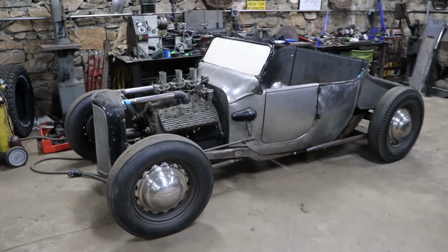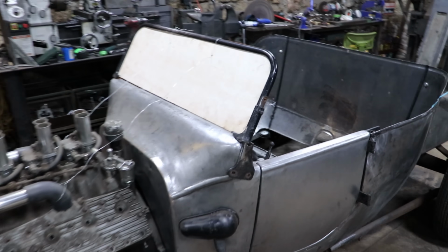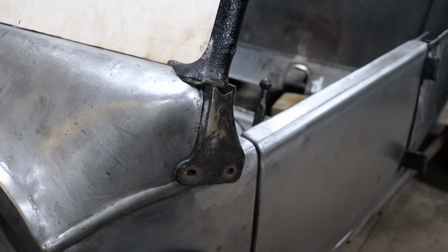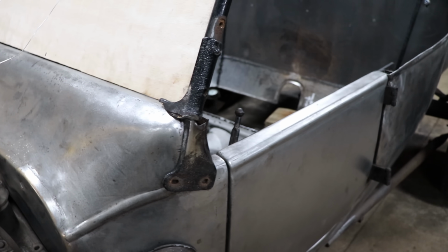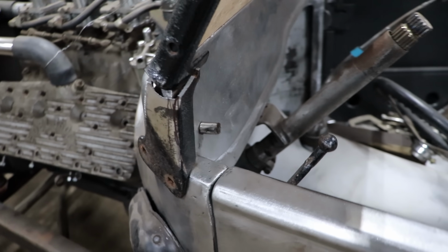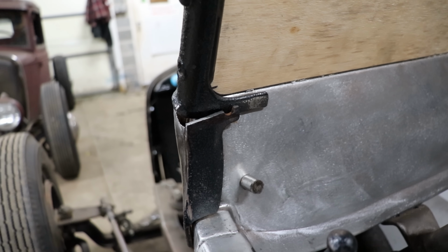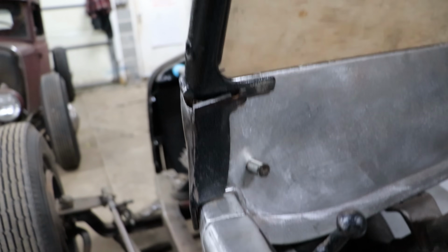All right, so Jason and I have been working on these stanchions, trying to get them closer to sort of fitting, so we've been slowly trimming them back. And you can see in here, this stuff doesn't quite line up, but what we're doing is we're trying to use the original pieces as a silhouette. So we have the bottom piece sitting tight at the bottom where it meets the dash in here, and you can see there are some overlapping parts. So where it's overlapping, we're slowly trimming it back, sanding it back to get everything to fit.